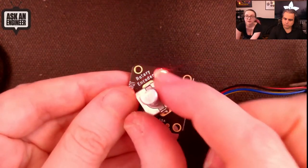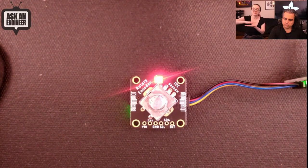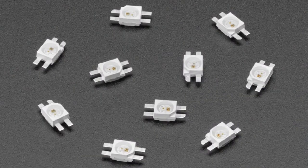And just don't forget, you need to have the cutout. This isn't like some LEDs where they have a J lead and they sit flat against the PCB. These, you actually need the little square cutout. So just make sure you do that. If you need a footprint, check out our NeoKey PCB on GitHub. You can use that, just delete everything else and you can get the footprint and the cutout that we've used.